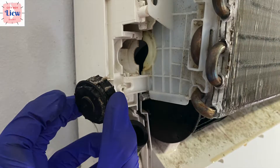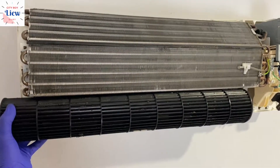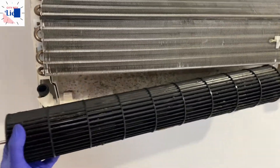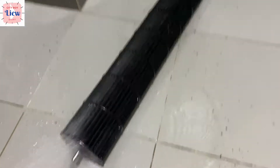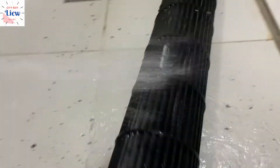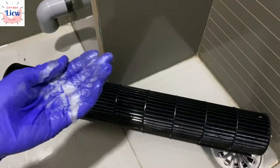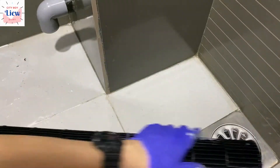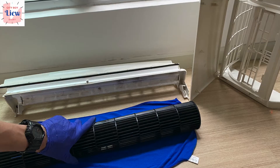Remove this rubber bush from the left, then gently pull this blower fan out and clean it. Normally, the dirt will be collected at the sides — this dirt will slow down the blower wheel and consume more electricity in the long run. First wet it, then apply some body wash onto the blower wheel to help clear germs and identify which areas have been cleaned.